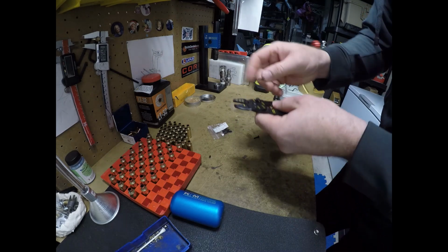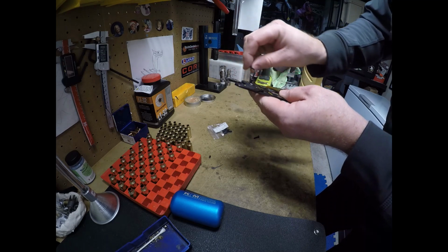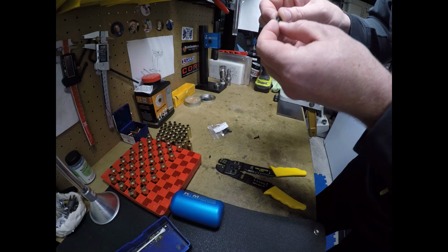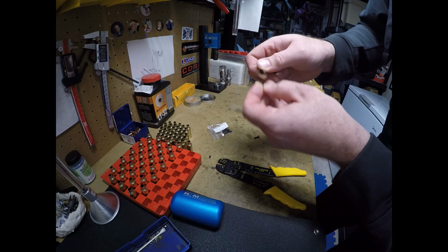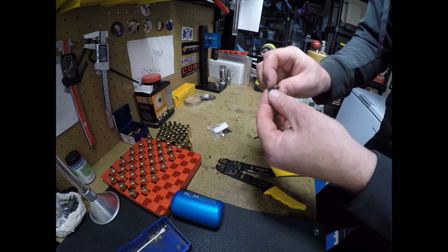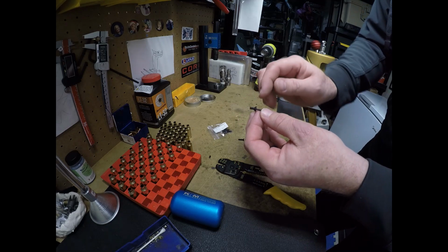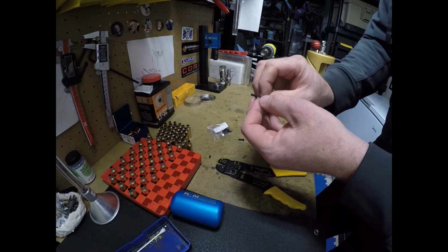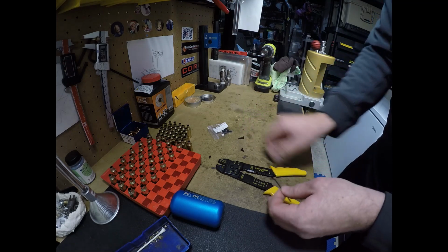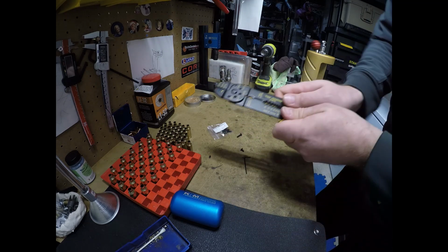Cut that bolt. What's neat about this is it's already threaded in there, so when you unscrew it out, it aligns all the threads correctly. The thread damage isn't much at all. I can actually see right where the lead for the screw would be. I've done this more than a few times with different screws, and there you go. I went from a screw that was way too long to basically cutting it in half, and now I can screw that into that sub foot and make contact with the counter bore there and have it appropriately set. So if you have electrical tools, you may have one of these sitting around, and it has different sizes to cut different screws.